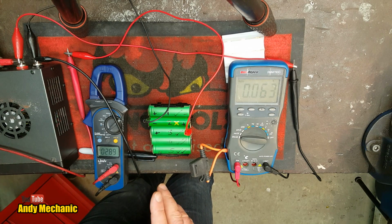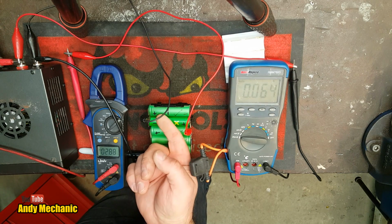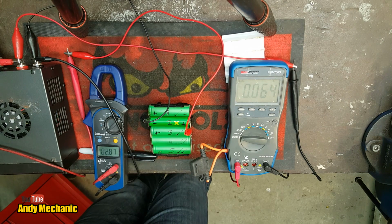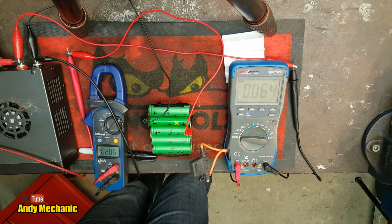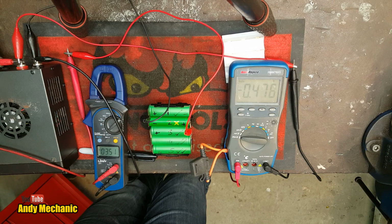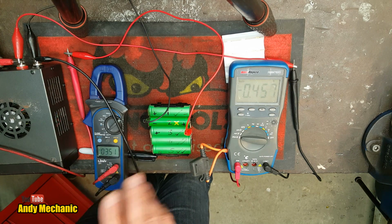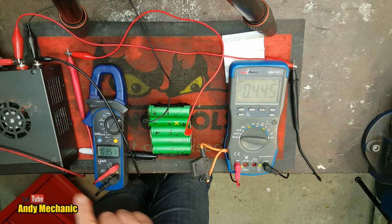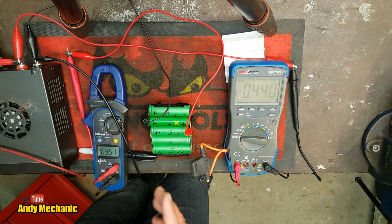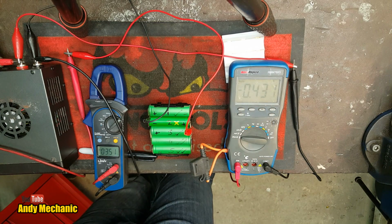Remember, the target voltage is about 3.7 volts residual. And every now and again I'll just keep checking to make sure that the cell isn't getting hot. If I see any smoke, I'm going to abort mission. Yeah, don't want it exploding on me. Okay, back on again. Now obviously we're not going to charge up to 3.7 volts at the moment when we're only supplying 3.5, but we'll bring the voltage up of the cell and then we'll increase the supply voltage a bit more. We won't give it a full whack of say 5 volts right from the start because the amperage flow will be too high.